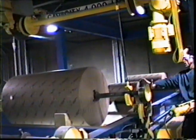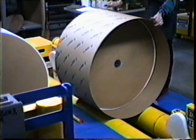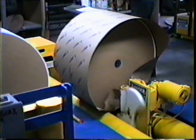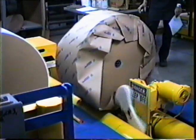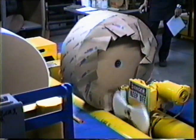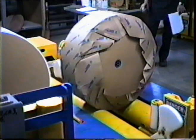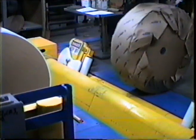To allow for roll heading, the edges of the wrapped roll must be crimped. In this system, inner heads are used to protect the exposed edge of the product. They are normally installed manually prior to wrapping and are held in place with a core plug. Crimping is an automatic operation, starting when the push button is actuated and running through a time cycle. If desired, glue can also be applied to the crimped edge during this operation. The crimping system is flexible, operating with a wide variation in overhang and roll width. Normally, five inches of overhang is optimal. As you can see here, very high diameter to width rolls can be successfully wrapped and crimped.